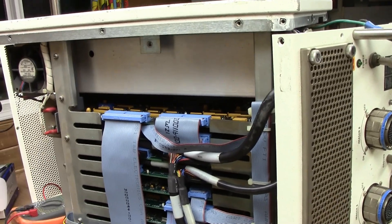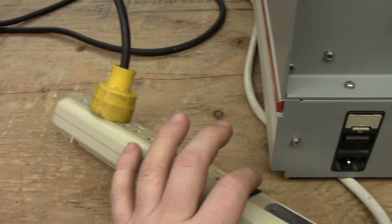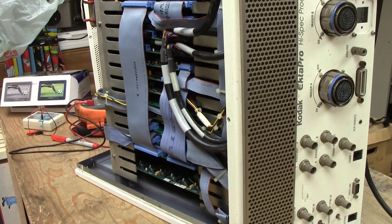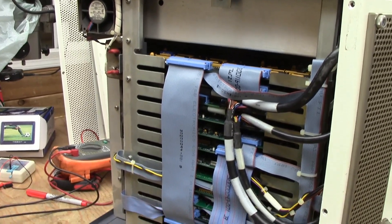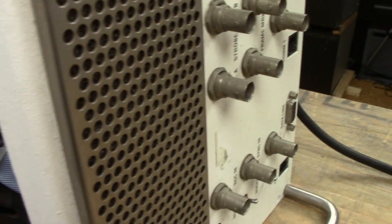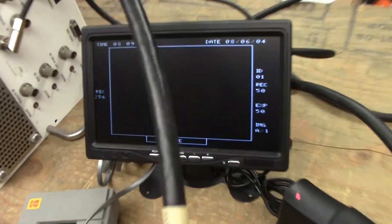We're all back together. I've confirmed the 12-volt rail is clear, so I'm going to keep an eye on that LED and turn it on — I really should be using the foot pedal for this. Let's see if it explodes: three, two, one. Okay, nothing exploding. I don't smell burning tantalum either — smoke test passed. Let me go plug in the remote. Check out this interesting turn of events: we no longer have corruption when I have the imager plugged in, and you can see the viewfinder is working now.